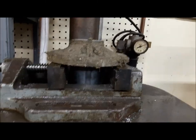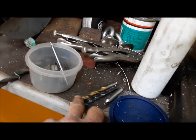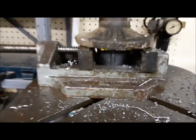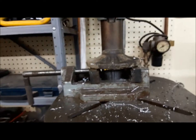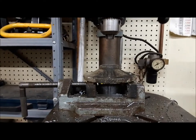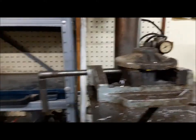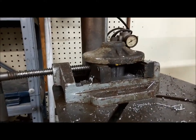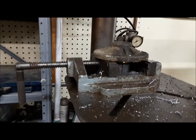Here's how I'm going to drill them out: I'm going to start with a center drill, then a larger center drill, then 3/16ths, then a quarter, and then 5/16ths. I've got these holes up to quarter inch now, so I'm going to go ahead and drill them to 5/16ths. To avoid this madness in the future, my spindles are going to be held on with bolts and nuts. I'll drill them out to 5/16ths and then go one more size to give a little clearance. We're also going to drill the side of them and put a grease fitting in, and pop the inner seal out of the bearing so we can keep these things greased.